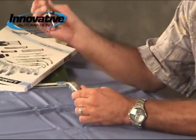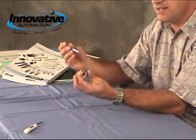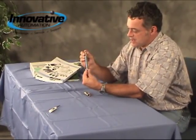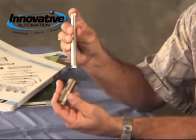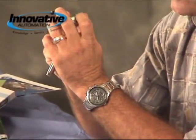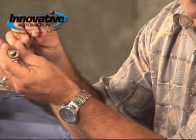It consists of two very simple parts — it has a stator and it has a slider. The slider is a magnetic pole, and the stator is a piece of ferrous material like plated iron. It actually has a bearing surface in the middle that you can barely see, but there's a Teflon sleeve inside there to keep them from touching.